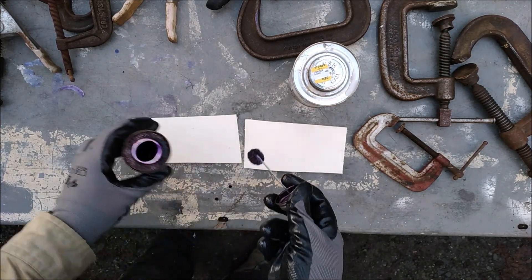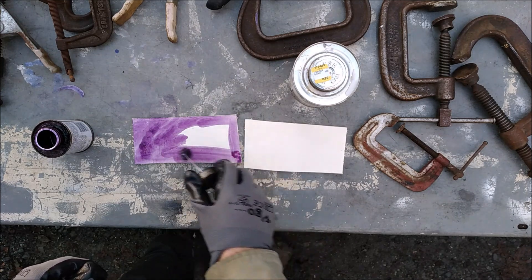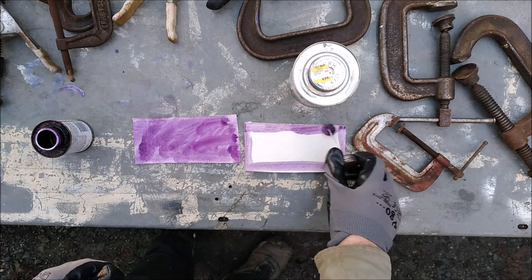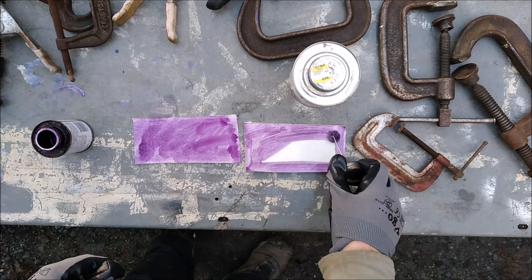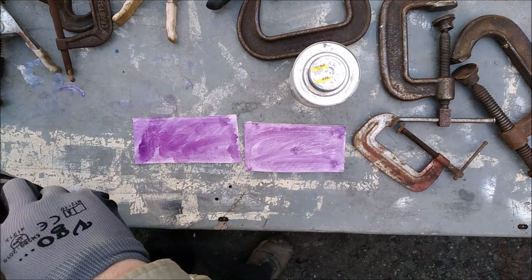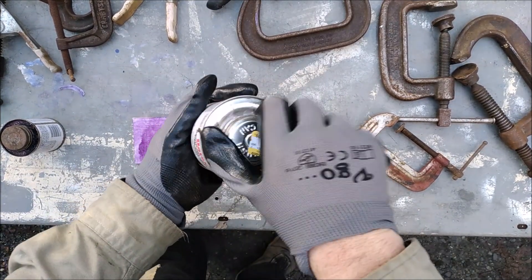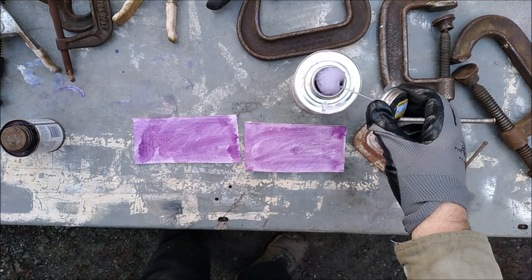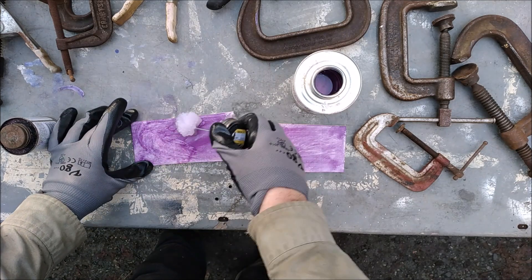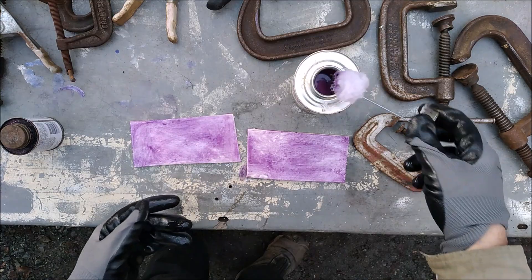Let's get some primer on here to give ourselves the best chance of getting stuff right. Primer is purple because certain plumbing jobs require primer by code — you want the inspector to take one look at your job and see purple all over the place and know you used primer. As an electrician, it's not required to use primer, so we never use primer — we only use cement. I think primer is required for stuff that is pressurized, like the water in your house. They give you this brush and there's no way to lay it on but super duper thick, but I guess they know what they're doing. It makes everything purple.